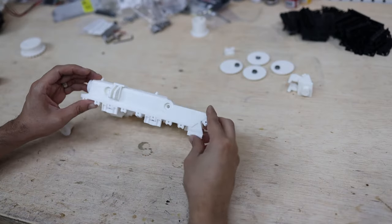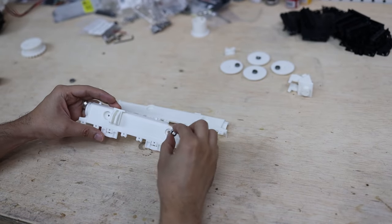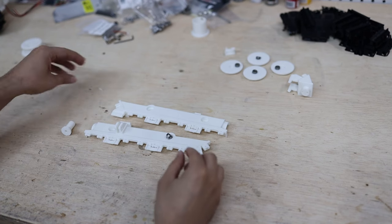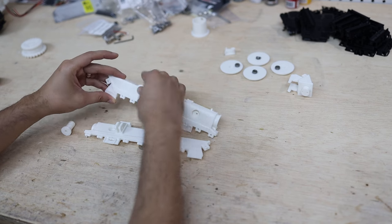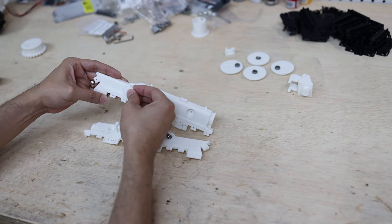The pieces are clear from the support and we are going to insert these five millimeter bearings here and here. For this one, because it's a little insert, we can use this piece to press the belt right here in this position.